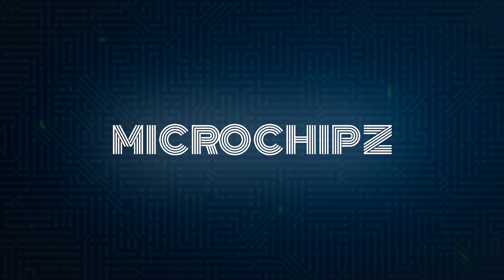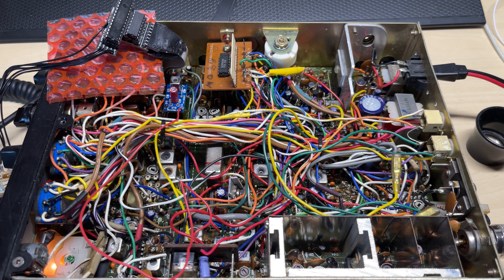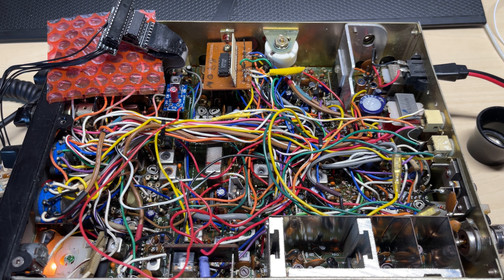Hello and welcome to Microchips. A while ago I was asked if I could make a VCO with an audio feed point for the FM audio modification for the Multimode 2 and its variants. People who've done this modification know you fit a varicap diode and a couple of other components onto the back of the board — and I was asked could I integrate this into the actual VCO itself. Luckily enough, yes we can.